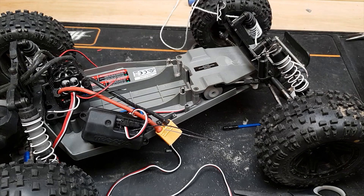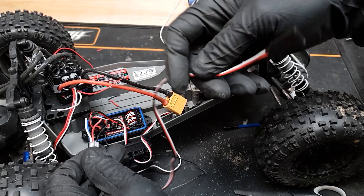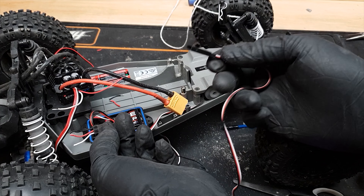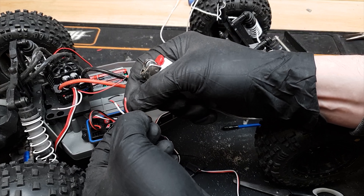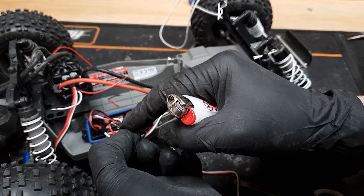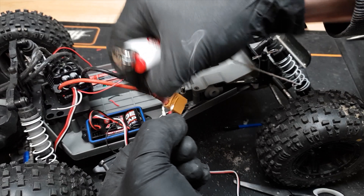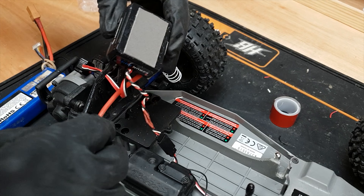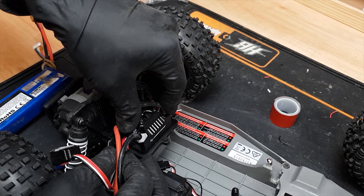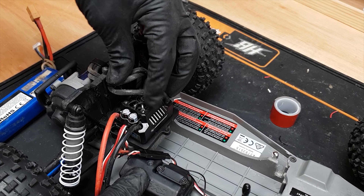Now I've got to sort out these knackered cables. I'm going to do it a little differently this time — I'll leave the lead coming out of the ESC short and put an extension lead in there, leaving this part sticking out. That way if I crash again it can just pull the plug apart rather than ripping the wire. A good trick for stripping wires when they're thin and fiddly: just heat the end up for a couple of seconds and the insulation comes straight off — you can literally pull it off with your fingers.